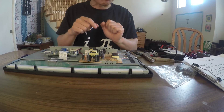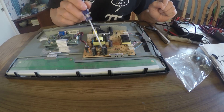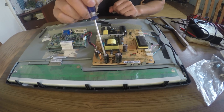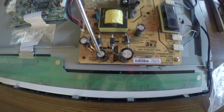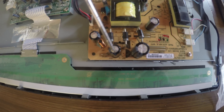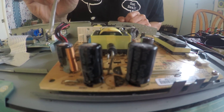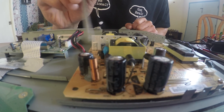You need to take the screw and open this enclosure — this is the power supply, and that's usually where the problem is. There are a few capacitors. This is a good one — see how flat it is. And this is a bad one — there's a little bit upward, it's no longer flat. This one also has some gooey stuff on the top and is not flat. So those two are potential problems.